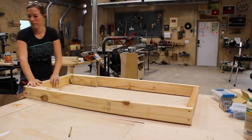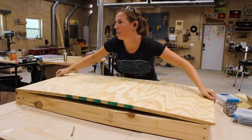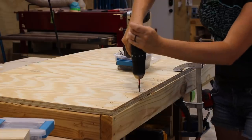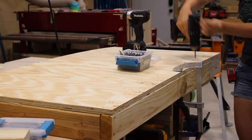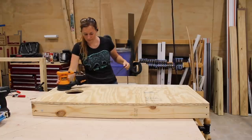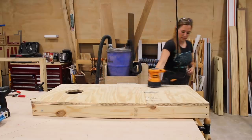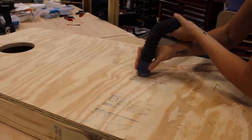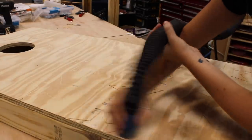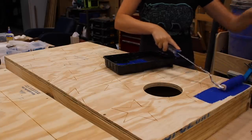With the body done, let's add a top. I'm using scrap for this entire project, so my piece of three-quarter inch plywood had a massive bow in it — no problem though. I placed the bow so the cup was facing down, then placed a clamp on the center to suck it down flat, pre-drilled in a few spots, and added screws. Instead of just painting mine, I took the tops off and placed them on my CNC to cut in a special design to make them pop a bit more, then put on some good music and gave them both a good paint job.